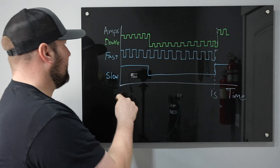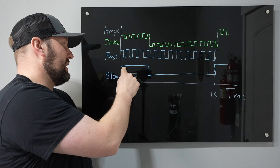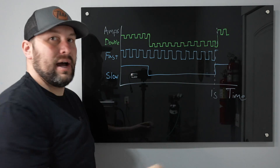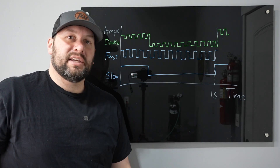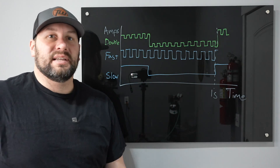Here's a diagram where this axis is time — from here to here is one second — and up here is your amperage. You can run pulse welding slow, going high then back low every second, and that can help pace progression. The other way is with a fast pulse, going high and low many times per second — this can go up to around 1000 pulses per second, but usually you're sitting somewhere between 30 and 240.